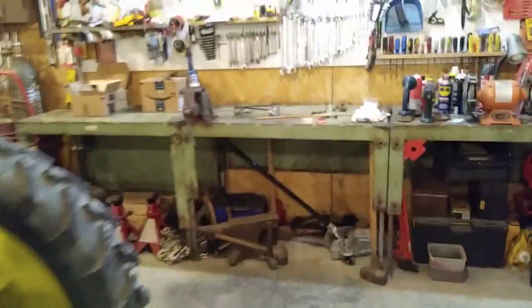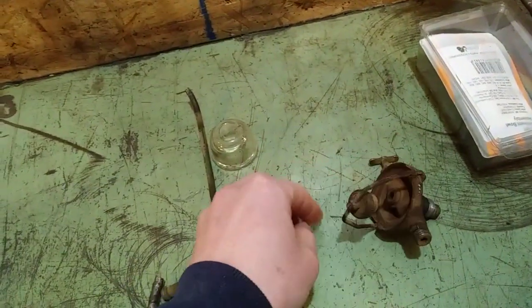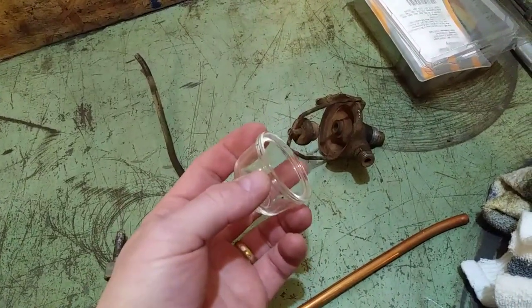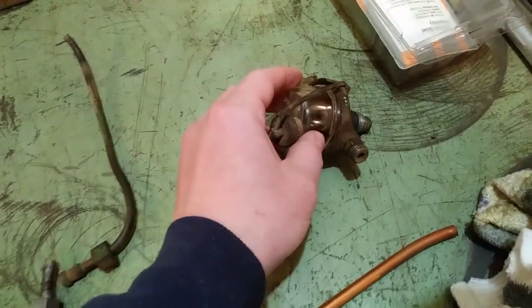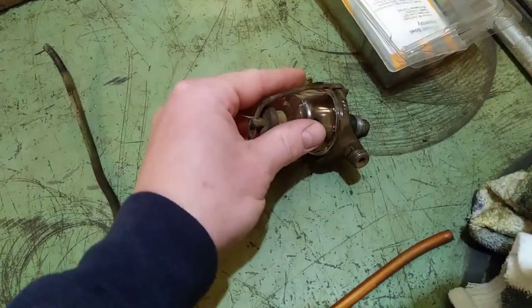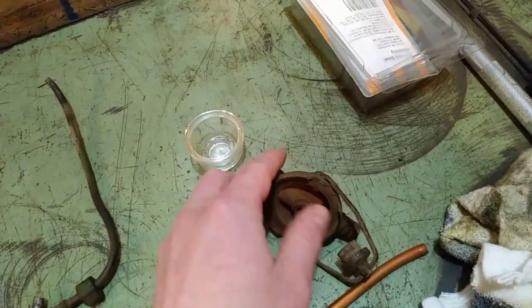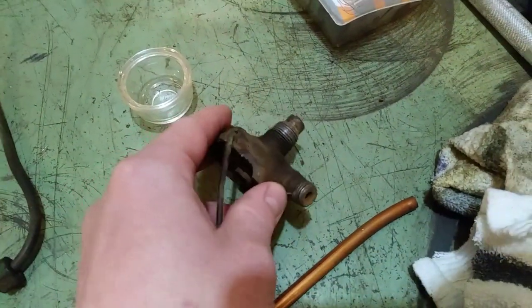The sediment bowl was leaking. Actually, the bowl itself is the wrong one for the housing — this is the old housing, probably original. That wire is for a short bowl; this is a short bowl, but it should have had a long bowl on it. You can see the difference in height between the two. Somebody probably broke the original glass at some point and just had this short glass laying around — you can see it doesn't fit. The packing was bad on the back, and when I went to remove the housing I cracked it, which is pretty common.